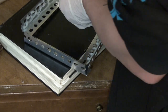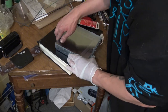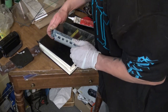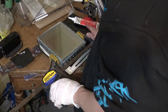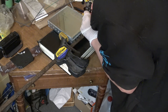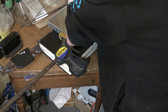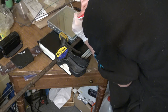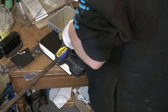Something I wanted to suggest for future testing: I used to use a product called SikaFlex, and I know it binds really well to polycarbonate and glass. It's often used for vibration dampening for glass. It's a type of polyurethane resin, and there are plenty of other rubbery resins that might seal the layers together better than plain silicone — or maybe a better grade of silicone sealant. It's an interesting suggestion I thought of later that I wish I'd tried during these initial tests.